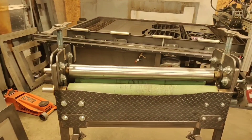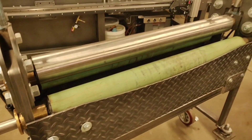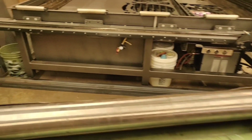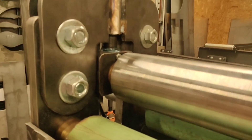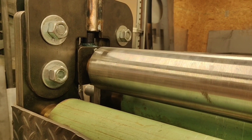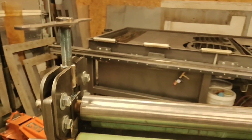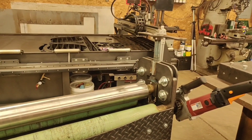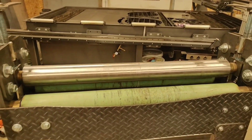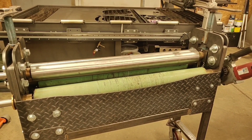Some things I still have to change: I need to shorten up some of these bushings — a couple are a little long — and I need to get it powder coated. These bolts are supposed to be pins; when I designed it I was going to put pins through there. I thought it'd be better to bolt it all together while I welded everything up so it would stay true, but I'm going to have pins on both sides so I can pull them and that whole top roller will slide out, making it easier to get welded rings in and out without having to stretch them over the roller.